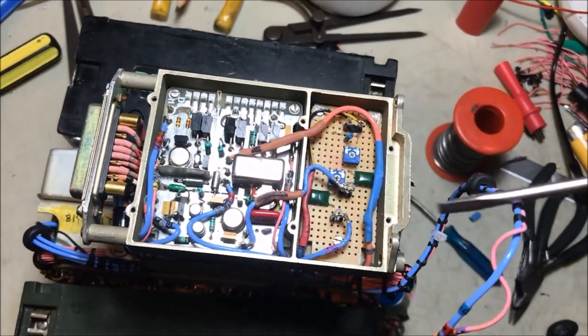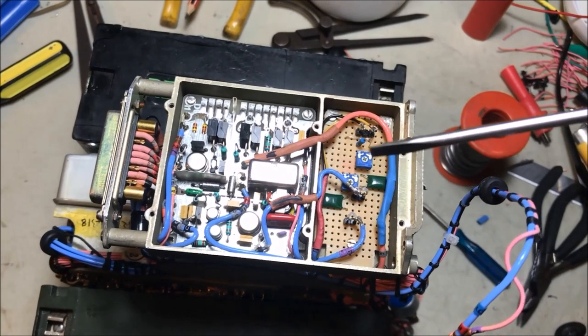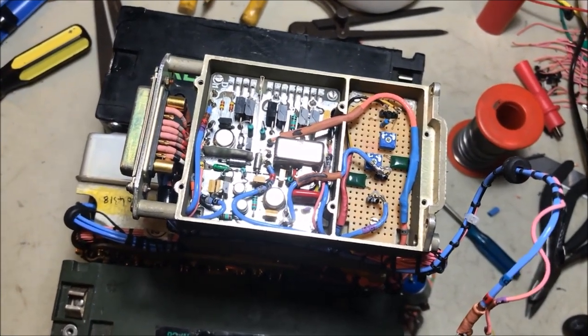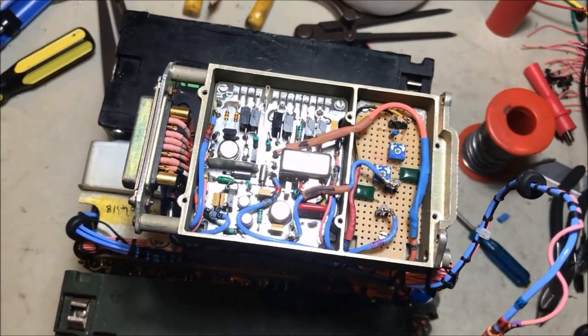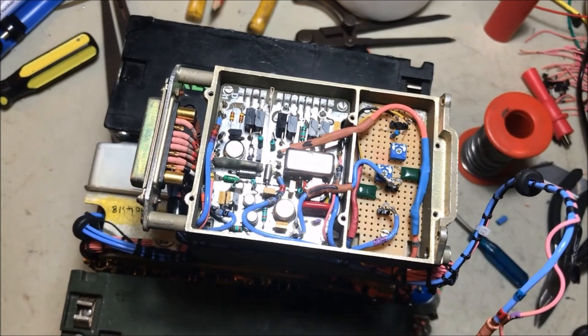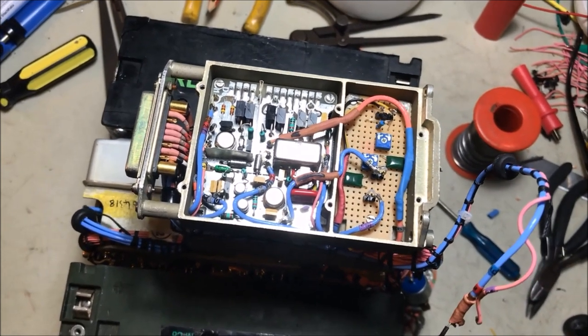After, of course, I've set the peak-to-peak values when I get it all set up with the new DDS running, and those peak-to-peak values have got to be between 300 and 400 millivolts peak to peak. So we'll get to that stage, I'm sure.